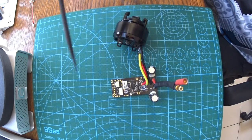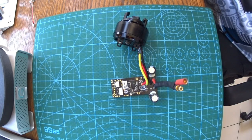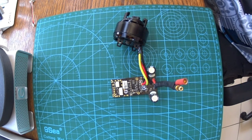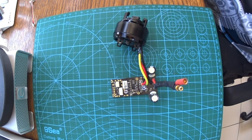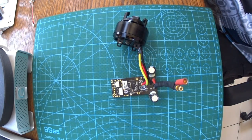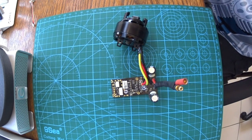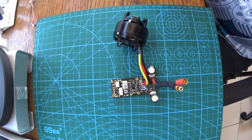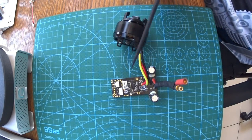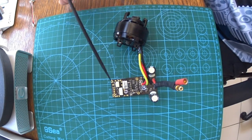Here's the problem I've got: these things went under water. The rest of the machine is up and running — I dried it out with demineralised water, then flushed it with alcohol and contact cleaner, and it's been through the reel. The flight controller and everything else works perfectly, but these ESCs don't. I put some other ESCs in the machine and they work.